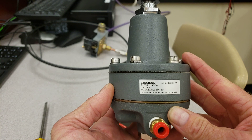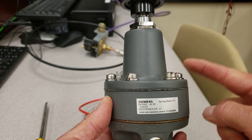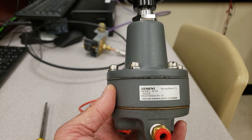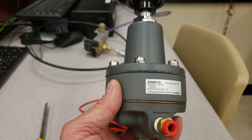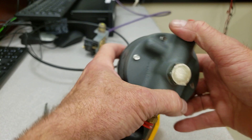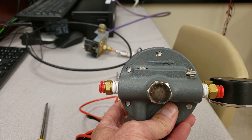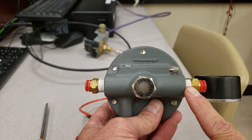We're going to use the 50 psi from our regulator over there and have it come into this precision regulator, which is then going to reduce the pressure down to between 25 to 40 psi. On the back end of the unit there is an arrow, so obviously you've got to have the air coming in on that side — that is the inlet on the regulator and the other side is the outlet.